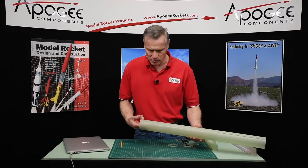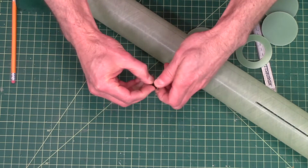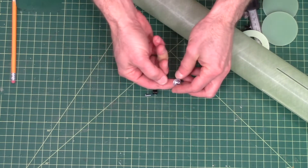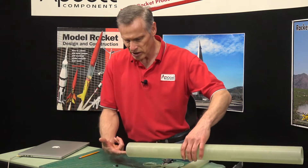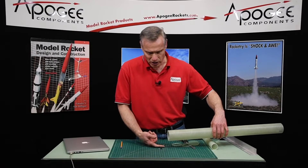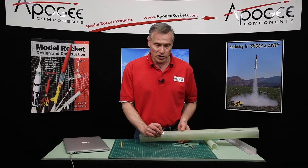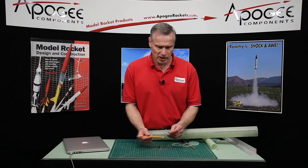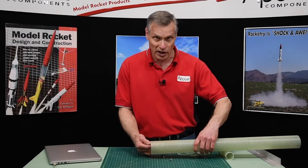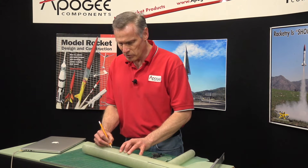I want it in front of that, so I'm going to put the hole right about there. For the forward one, it really doesn't matter. It's a two-part system: there's a weld nut, a little screw, the rail button itself, and the weld nut goes on the inside. So we need to be able to stick it into the tube and then pop it up. My fingers are only so long, so if you have a small hand you might get it in there, but we're going to use a trick of sticking this on a wood dowel — put a piece of tape on a wood dowel and stick it like that, then I can stick it in and pop it through the hole.